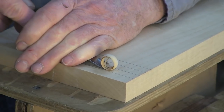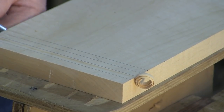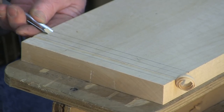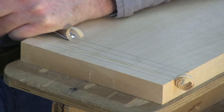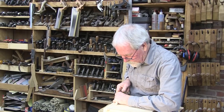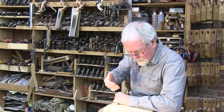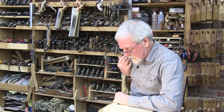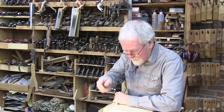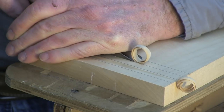You'll notice that shaving changed in width as I went across — my cut was sort of undulating. This time I'll try to do it a little bit better. If I have my wrist nailed to the bench top, that's the best way. My whole forearm is on the surface of the board and all the propulsion is coming from my shoulder. I'm tucking my arm in and not necessarily using my arms to push, but using my whole body to just push the shaving along.